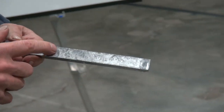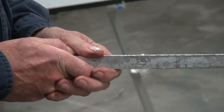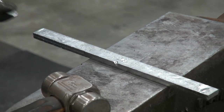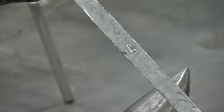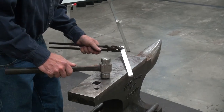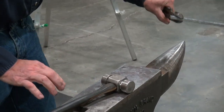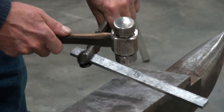By putting it close to the edge like that, you can see it. And if I turn it around, you can still see it. So when my steel goes in the fire, I want to be able to just glance in there and know exactly where the outside of that shoe is going to be — that is where I'm going to grab it to bring it out of the fire, so that I'm fully prepared right now. If I grab it on the other side and have to come to the anvil, set it down, and turn, I'm just wasting my time. So I want indicators, so I can come out and I'm on the grid — whether it's going to be a bump or I'm going to turn the toe, I can always see it in the fire.